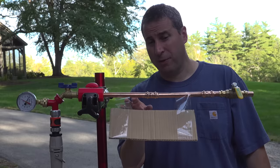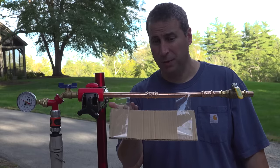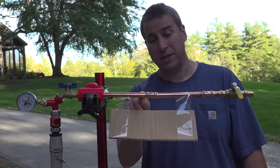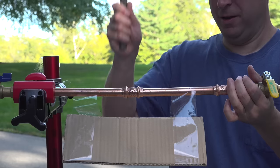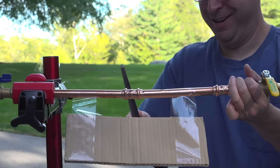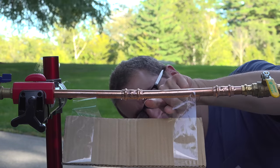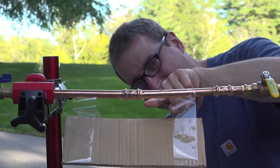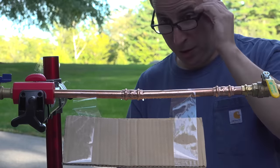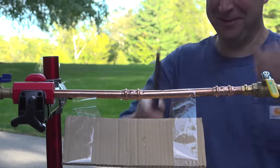If you've ever hated ProPress because of those o-rings, I don't think I would hate it much anymore, because I don't think the o-rings are really doing much. They must just be there in case you have a small weep in the copper or an imperfection that lets out a little bit of water. Now I do see a tiny leak — yeah, now we're getting a little bit of a leak. So if you were to take a wrench and beat on the fitting with no o-rings, you'll get a couple of drops of water.